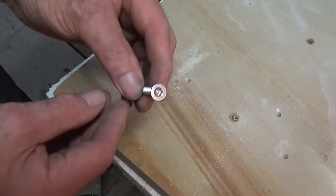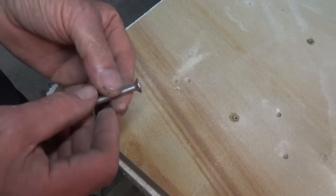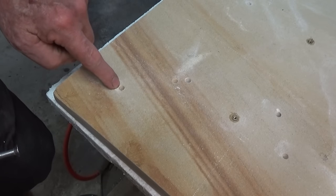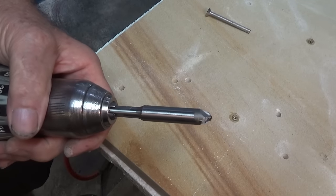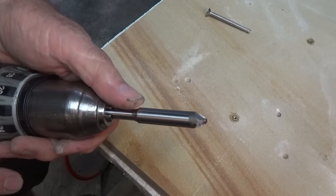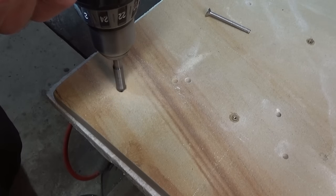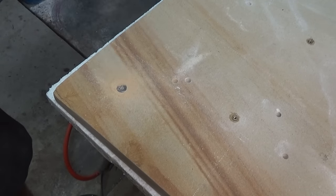These are the stainless steel security screws to hold the sandstone to the front gate. They're countersunk, so I need to put a corresponding countersink in each of the mounting holes. I purchased one of these Kango stone and porcelain drill bits and I'm using it as a countersink - expensive purchase, but it does work.